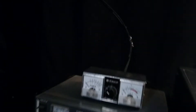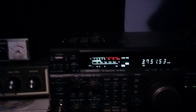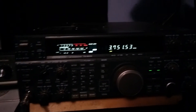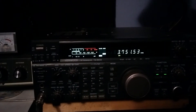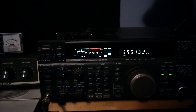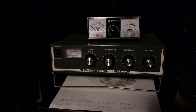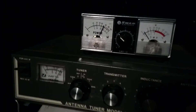These are 6.3 volt lamps, so at 80 meters with a six-inch piece of 300 ohm twin lead it doesn't generate a lot of voltage for them. We'll turn this lamp off so you can see it. We're kind of already tuned up on 80 meters and we'll show you how it changes from band to band. The antenna is a half-wave dipole on 80 meters, fed with 300 ohm twin lead through the VS-300A tuner, which has a 4-to-1 balun built in.